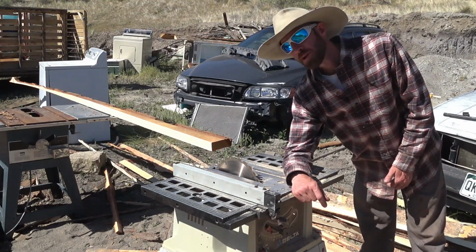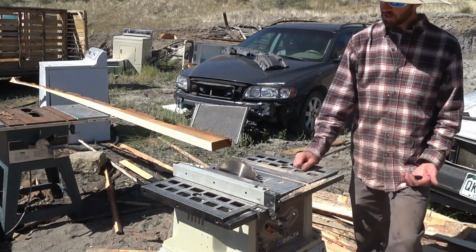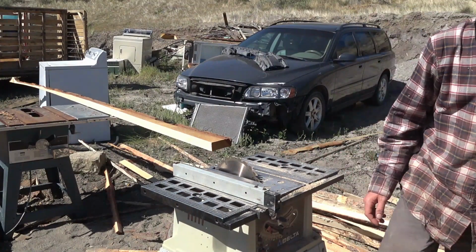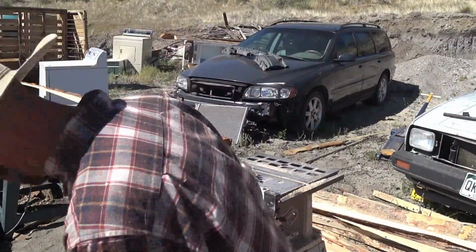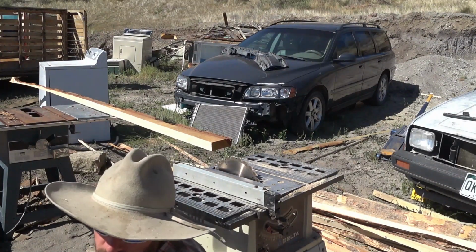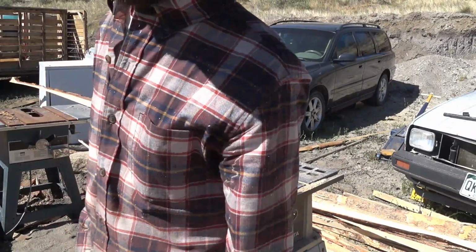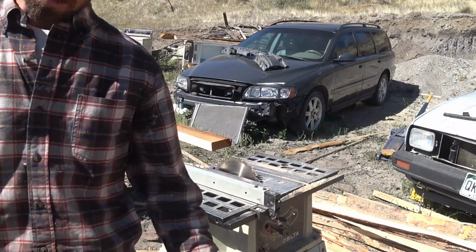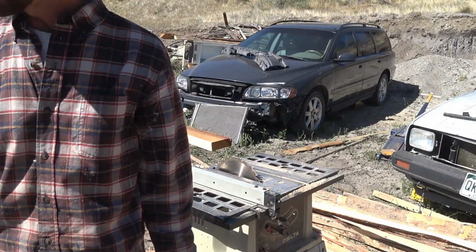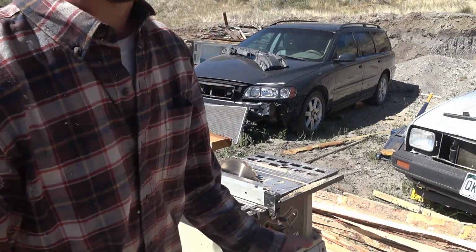Depending on the board, we've got 3 different types of boards that we're making now, which is a 2x4, which again I told you is not actually a 2x4, but rather a 1¾x3. We're also going to have 1x4s, which are actually more like 7/8x3, just under 1 inch by 3. And also we are going to make, quote, 2x2s, which are just 1¾x1¾.